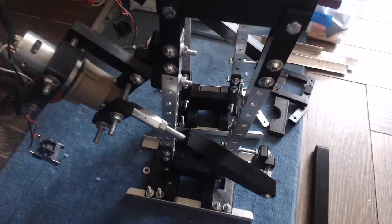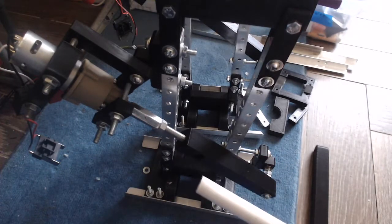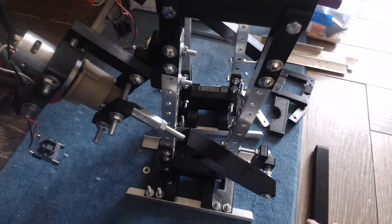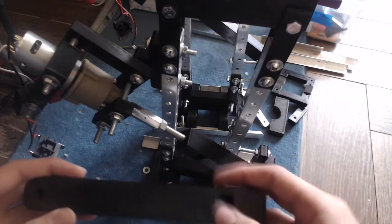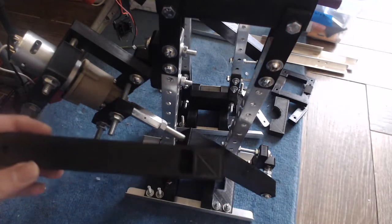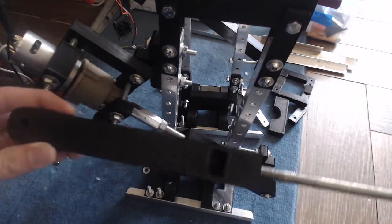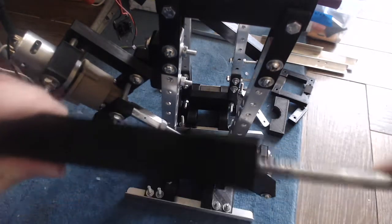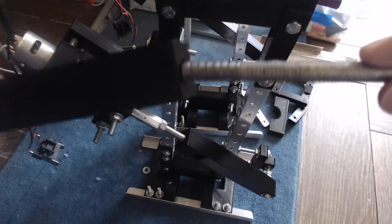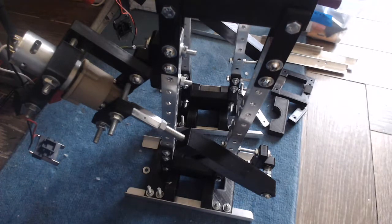These are the same kind of linear actuators which were on the robot before. The only difference is I used to have a piece of pipe here with a hole in it, and I replaced that with a 3D printed part. It's this part, and you could put a captive nut here, and then you have a 3/8 inch rod, which can go in and out. And even without the captive nut, you can see the plastic will screw in. See, I can't really just push it in there or pull it out. You have to screw it, which keeps everything tight, I guess.